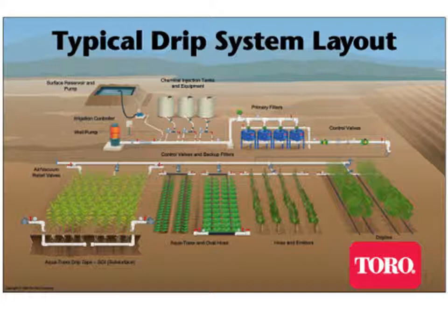This is a diagram showing the components of a whole farm drip irrigation system layout. You can see we start with some sort of water source and then in many cases we may inject fertilizer. We have a filtration system in place. The water is then distributed out through mains and sub-mains and then runs down the individual trickle lines or T-tapes to water the actual crop row itself.